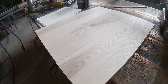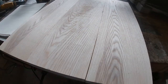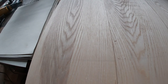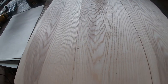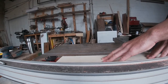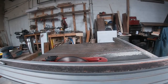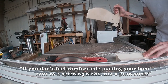This is a section I like to call troubleshooting shitty tools. As you can see, these gaps are pretty atrocious. Now, while it might have been my jointer technique — let's blame myself first and then blame the tool afterwards — that means I've got kind of one good side but one not so great side. So what I'm going to do is run these things through the table saw to true them up. Despite what you've already seen here, safety first. If you don't feel comfortable putting your hands next to a spinning blade, use a push stick.